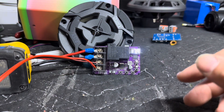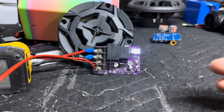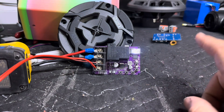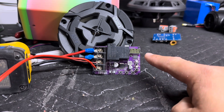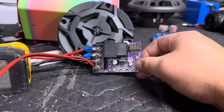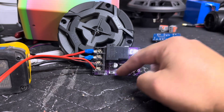This module can be used for charging or for discharging — in this case we're obviously discharging to some LED lights. If you were hooking up a charger, when it reached that low threshold the charger would kick on, send power through here, and you'd be good to go. This is actually a pretty good module for adding to boom boxes if you want to add a charger all the time. The LED just went out, so this thing is drawing no power now. You can hit the Set button if you want to pop the display back up.